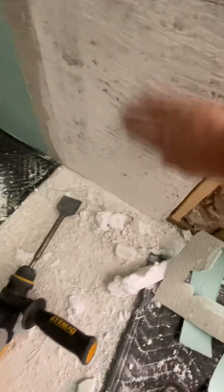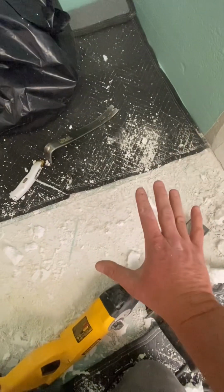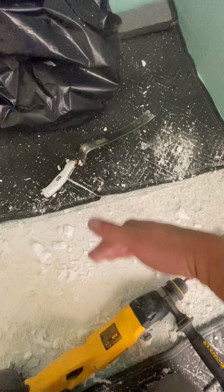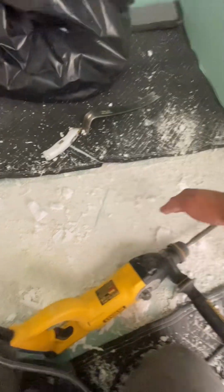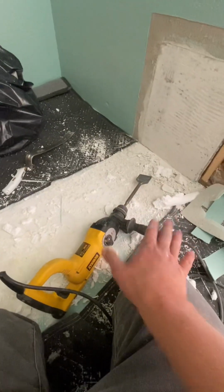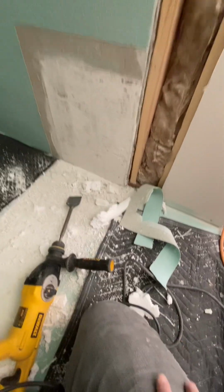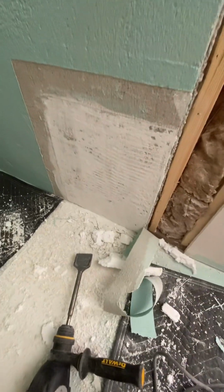So I'm just cleaning all the thin set off, and then I will mark a line where my shower pan will now start. So the slope ended here. I need to bring the slope back to here. So I'm gonna cut that, chip that mud out, re-slope it, and then set a new bench 6 inches further back. So kind of fun, hard work actually, always educational.